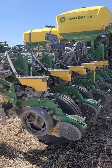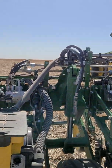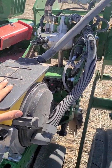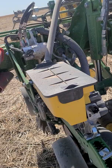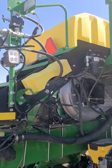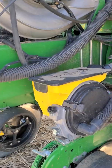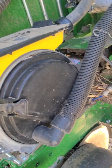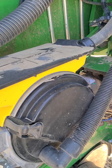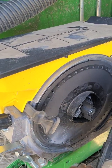What the fan will do is blow air through your seed tubes all the way through to your hoppers. Grab your yellow hopper catch — ours is mounted on the right side of the stairway — and set it up right here. Open up these doors and catch all the grain that falls through. Take your seed plates off and catch all the grain; there will be air pressure shooting that grain down into the catch.